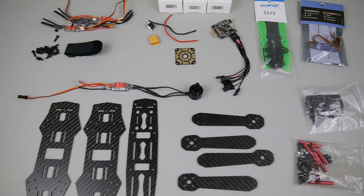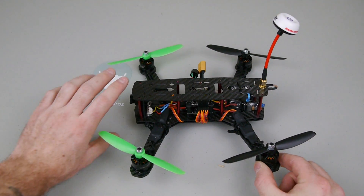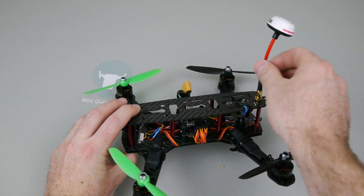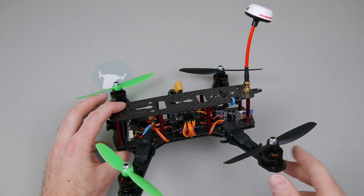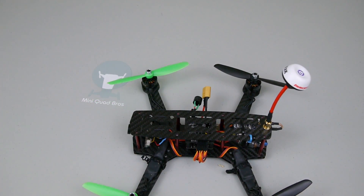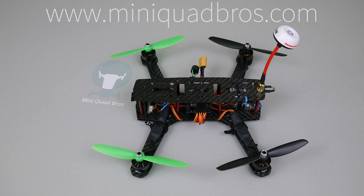If you guys have any questions about what's included or anything else, just shoot me an email or comment below — I'll leave the link to the website in the description. My brother and I built one over the weekend to get him started into FPV. Everything we used is basically the same except we added FPV equipment: a 200 milliwatt 32-channel video transmitter with an ImmersionRC antenna that's left-hand circular polarized, and a PZ0420 FPV cam. You can see the flight controller stacked on top of the power distribution board in there. He's been crashing and really enjoying it. Subscribe to the channel if you want — take it easy.